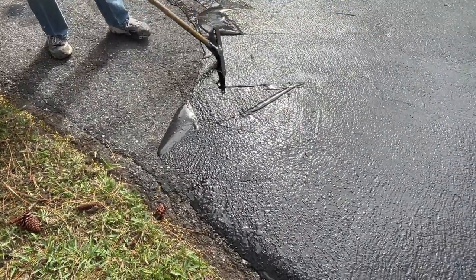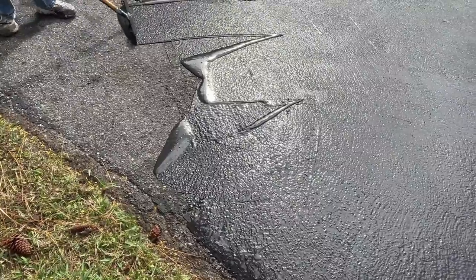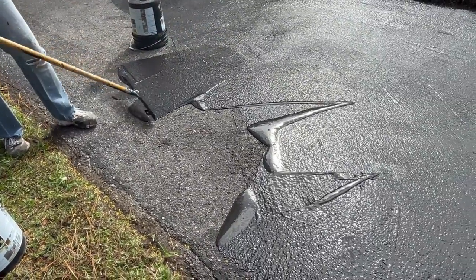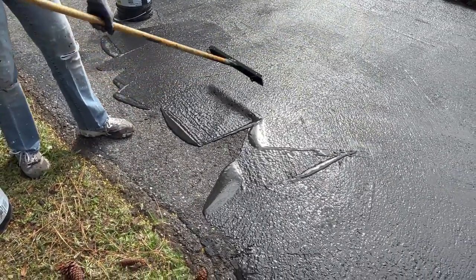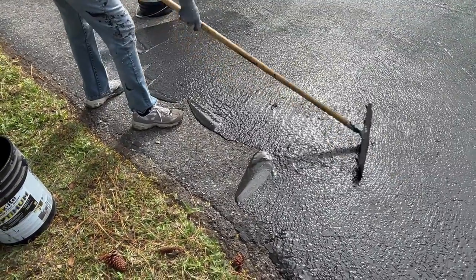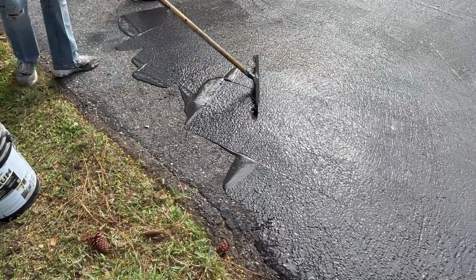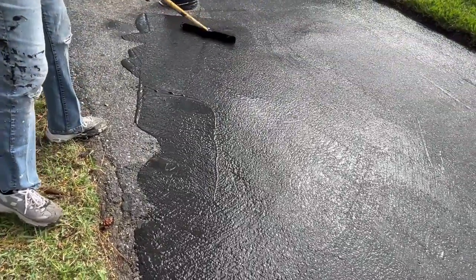You really just want to get everything into the grooves, prevent any visible lines, and fill in all the little tiny cracks. Work it back and forth until coverage is sufficient, bringing it all the way to the edge. When you get to the bottom of a bucket, flip it upside down so you get all the material out without wasting any. Don't put too much material out — put a nice amount at the wet edge but don't overdo it, and don't push too much product into the edge.